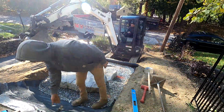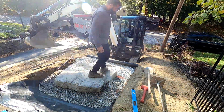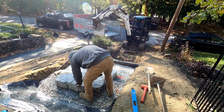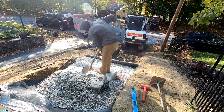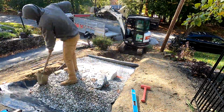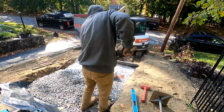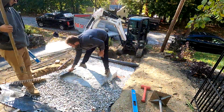It's very helpful. If you're going at a little bit less of a steep incline, you can either not use it or you can use less of it, maybe one every 2 steps. But if you got it and it's okay to spend the money and it's in the budget, just send the geogrid on every level. It will just give you some cheap insurance on the project itself.